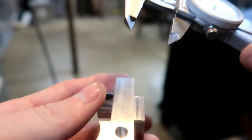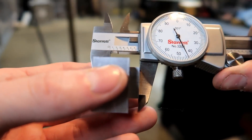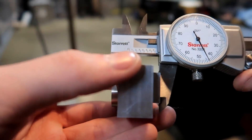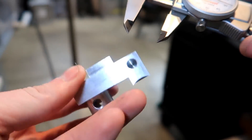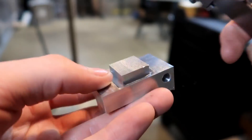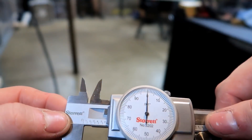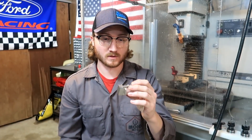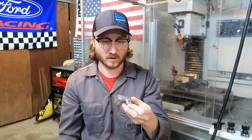This overall thickness is supposed to be about three quarter and we're about six thousandths under — that's getting on the edge of no good, actually that is no good. I'm guessing when we flipped it over to do the last operation, that's when things got a little squirrely. It's supposed to be 0.6 but overall I'm pretty happy with it just to see what could come of it the very first time. I know we can get that overall thickness down to a better tolerance. So I think that's it for now, thanks for watching.